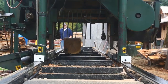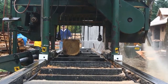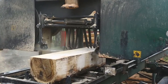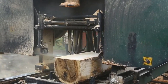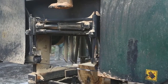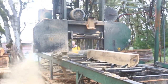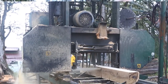I noticed you saw about half after facing the rifts on the sides, but it's not going to dry flat that way — it's going to cup. In fact, the first few cuts done that way will cup the worst. Those are just plain flat boards, and that's what they are. Now, once I got down to the half I flipped it up — the first board is flat, then I got a couple rifts, and then the ones in the middle are quartersawn.